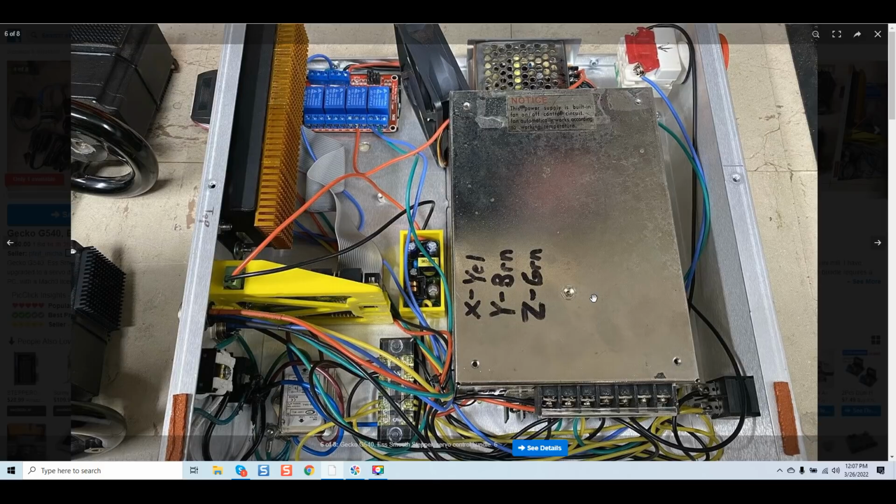So again, guys, I hope that this video has been helpful. I like seeing a direct comparison between G540 systems because I sell so many of them. I get asked so many questions on them. There are so many variables with them. Even though they're a basic integrated drive system, there's still tons of options. Again, dealing with the master system enclosure, and then options to add VFDs and options to add switches if you want them. Even though I still recommend using soft limits first before taking that deep dive into that investment and the headache of building the cables and whatnot, if that's what you plan on doing. Look at your big picture first.